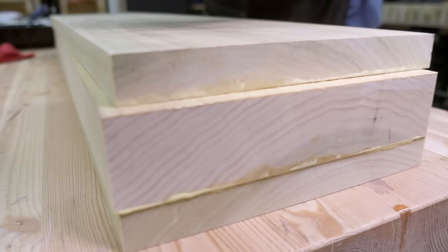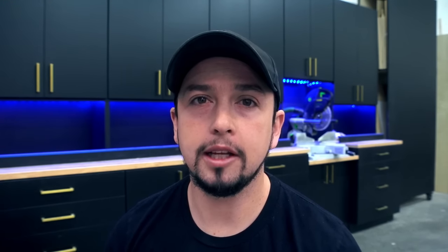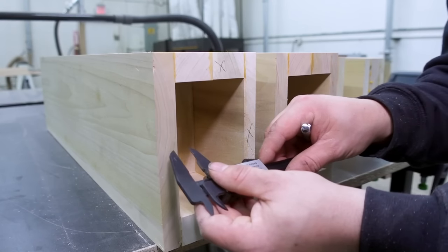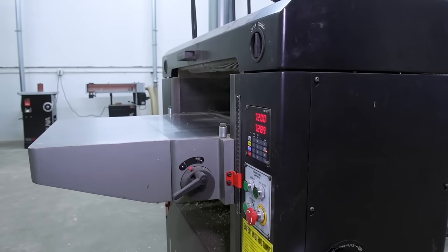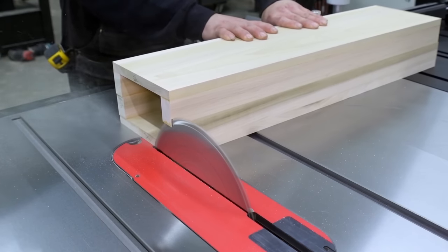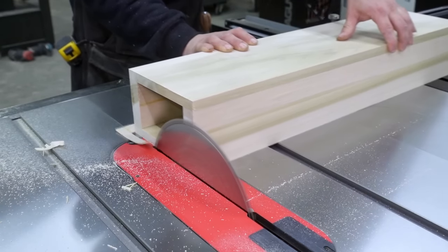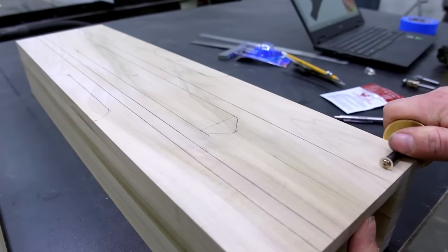These will become the two trestle columns, and the arced flying buttresses will be cut out of the next glue-up. After the glue is cured, I have to be careful when cleaning up the faces of the columns because I want the shoulders to be equal. Each opposing shoulder is equal so the tenon will be centered. The columns have several intricate cutaways and beading to enhance the gothic feel, so a quick layout will help guide my next steps.